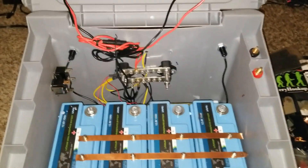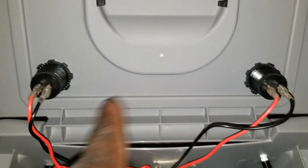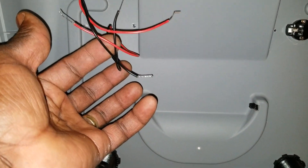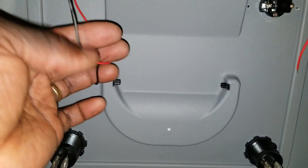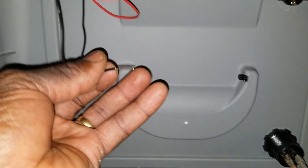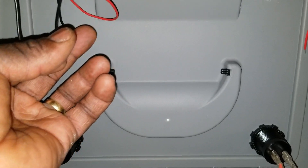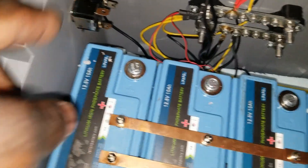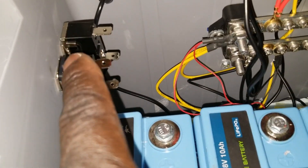This is where all the USB Type-C and USB 3.0 ports are. I have to wire these guys right here — all USB 3.0 and Type-C — and tie all the negatives and all the positives together. Then we can get it situated. I'm probably gonna put a switch or wire these and bring it to this switch right here. I haven't designated which one is doing which yet.